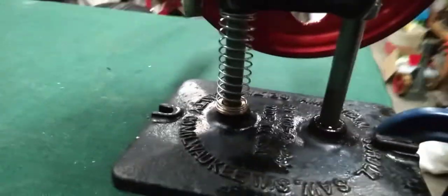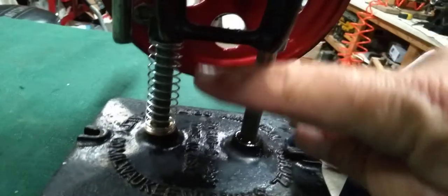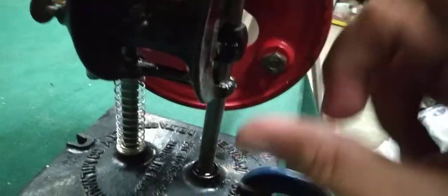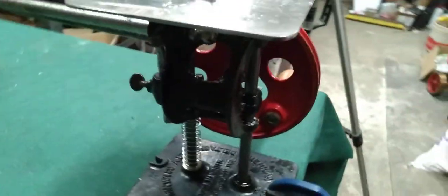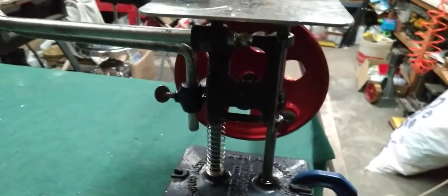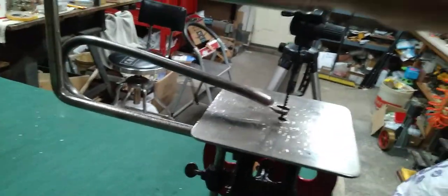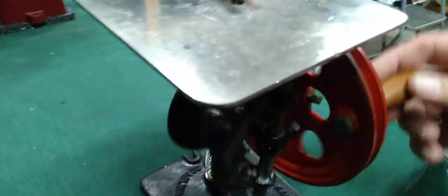I did a sympathetic restoration on it. It was really intact — didn't need anything but a little cleaning up and a little lubing. I did one modification, and that's just to add this spring right here. Because this is really not so much of a balanced unit — all this weight rests on that axle right there, so it tended to want to just always drop to the bottom. Since I'm going to power it with a steam engine, I want it to be a little more smooth. So that spring helps raise all this moving weight up, which is this whole rod and all that right there. I imagine that's a good two pounds, so that does help with that.